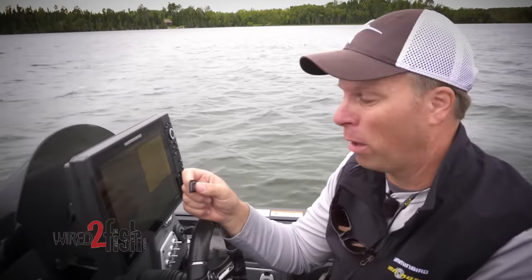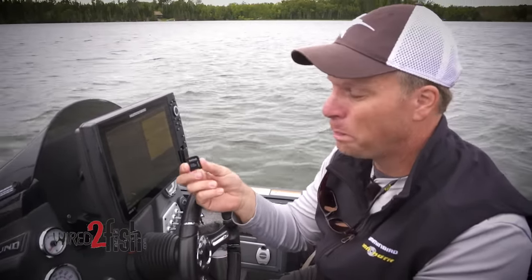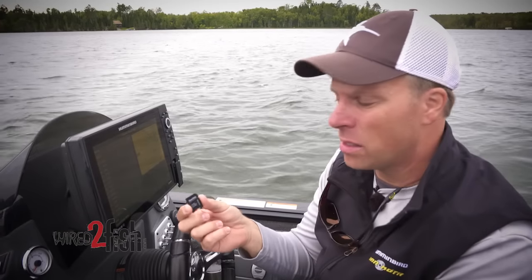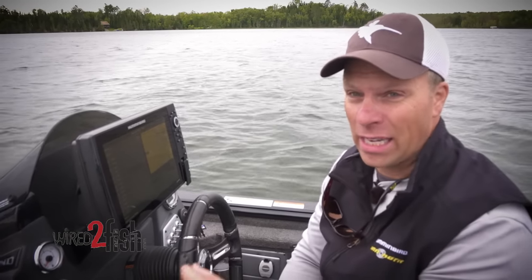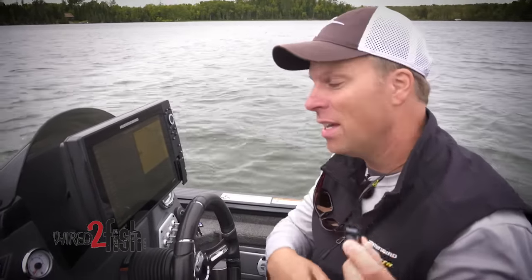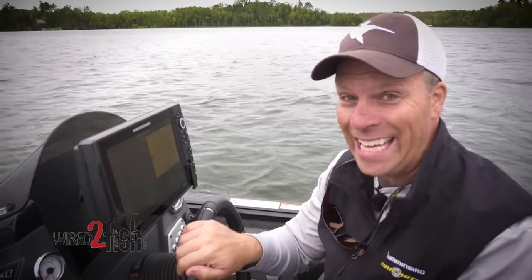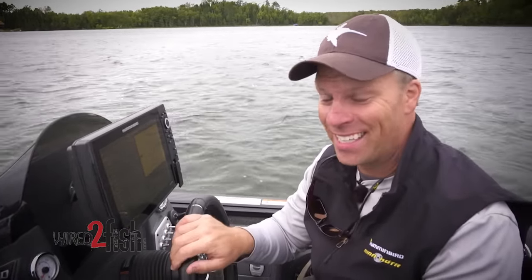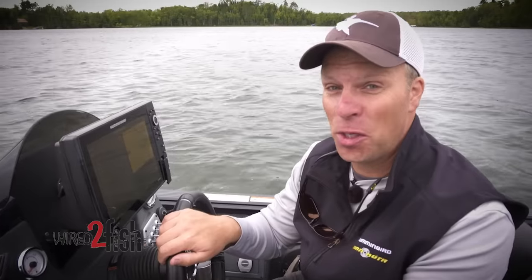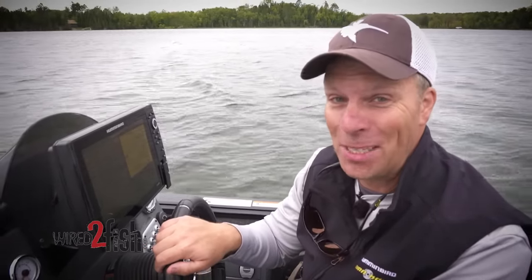You back up your computer, you back up your smartphone — do the same here. On this little SD card I've got all my waypoints. I can take that home and on my PC, or your Mac, whatever it is, you can make another file and keep it in a third place. You have the SD card, it's also on your computer, and it's again on your control head. I cannot stress how important it is to back up your waypoints — it will add years to your life and prevent a moment of extreme panic in case something goes bad.